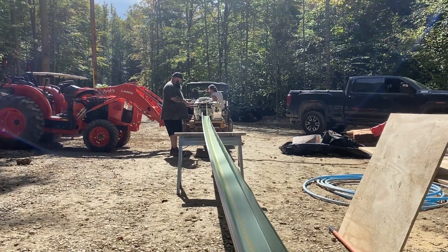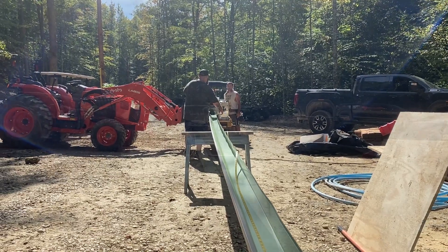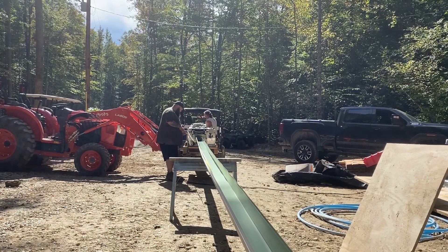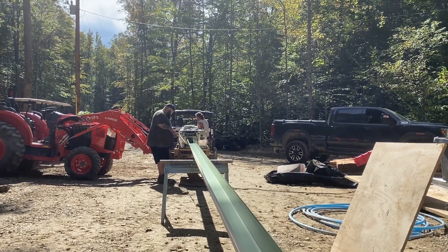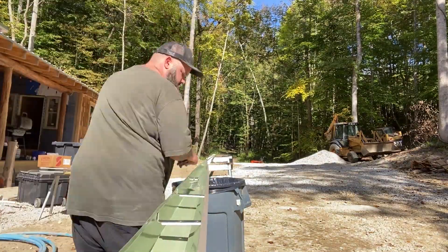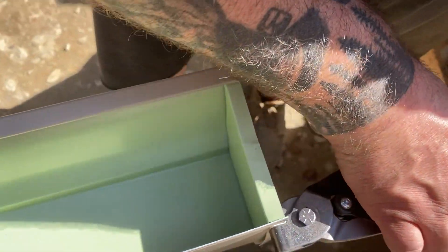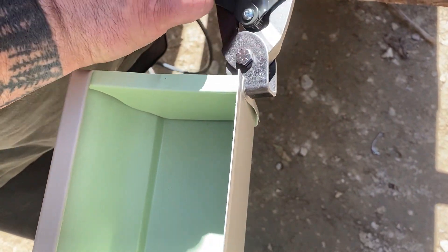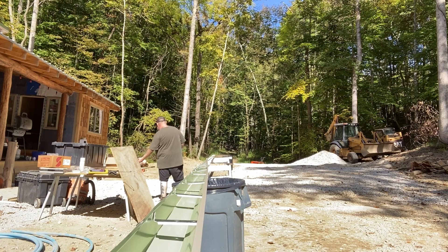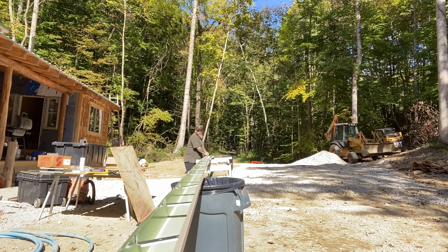The last order of business for the outside part of the system is to hang a gutter — we've got to have something to collect the water. I happen to own a gutter company, so I also happen to have an extra gutter machine in my shop — I understand probably no one else in the world does. These gutters come out the end of the machine kind of like a Play-Doh fun factory, as I always say. We crimp the end caps on with a special tool and put sealant in there to make it waterproof. Always install your hangers first — I see people every now and again trying to tack the gutter up and get the hangers in afterwards.